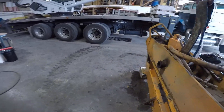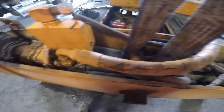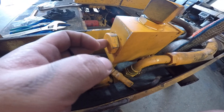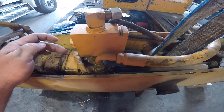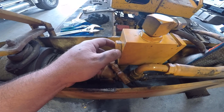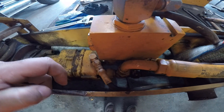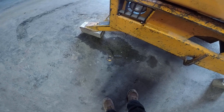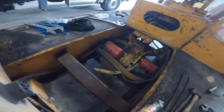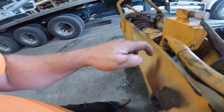Anyway, what we've got: there was a hydraulic leak in this front axle. It's a hydrostatic drive, so we've got two drive motors, two brake units, and then we have this block here. In this block is a valve — a flow divider combiner valve. What had happened is it worked loose a little bit and backed itself out, and in doing so it allowed pressure out through the O-ring, blew the O-ring apart, so it puked a bunch of oil out into the axle housing and started making a pretty good mess on the floor. In order to get to it, it was kind of stashed down underneath that frame rail — you couldn't get a wrench on it — so I just pulled the whole front axle assembly out.